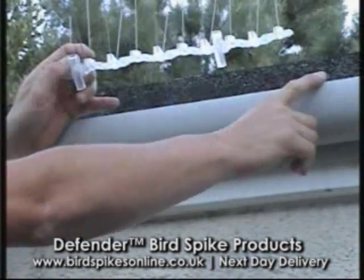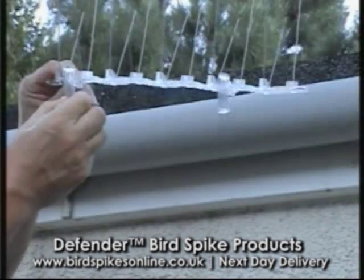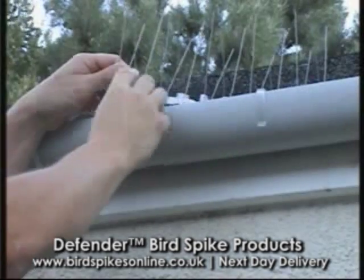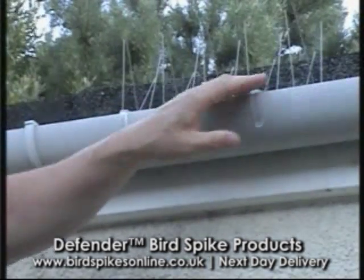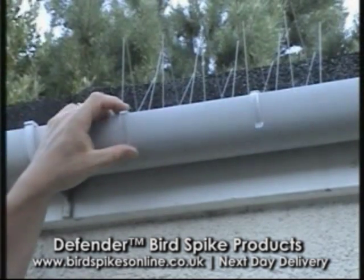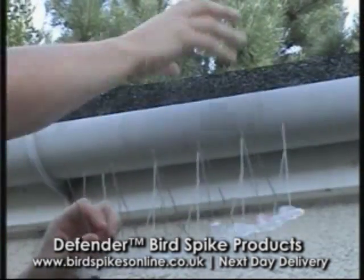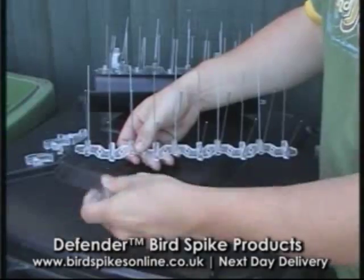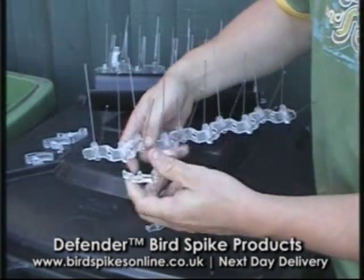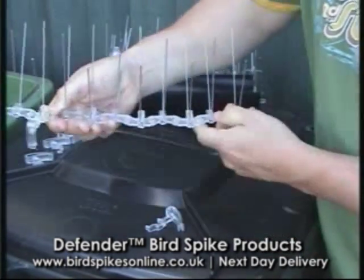Here we've had a problem with pigeons in the guttering. I've just put on some of our gutter clips, and that just pushes on the rim of the gutter, and that's locked into place and obviously stops the pigeons going into the guttering. If you need to clean the guttering out, of course it could just be popped off, taken out, cleaned out, and then back on again. You need 2 clips per piece of gutter. You simply take the clip, just push that in there, and it just snaps on.